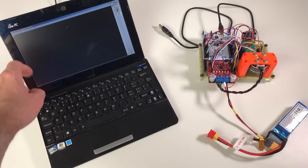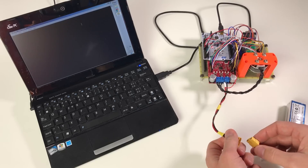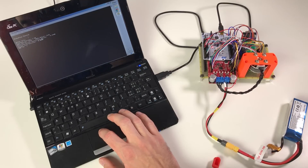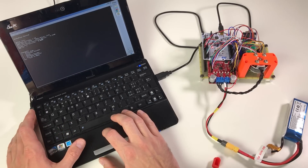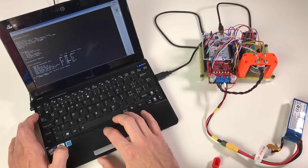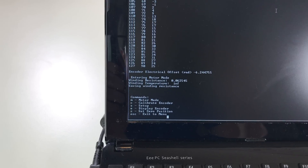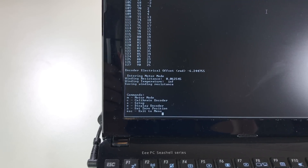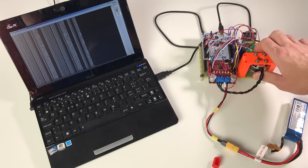To connect the serial I use TeraTerm. It's detected as an external drive. Now we connect the serial port, connect the battery, and push the reset button. Immediately we get information about the board, and if we push escape we get the commands: motor mode, calibrate encoder, setup, display encoder, and set zero position. The first thing to do is setup — I've already put all the parameters for my motor and driver board. You can also do calibration, which gives you the electrical offset and winding resistance. You can also display the encoder data, which is very useful to confirm your encoder is working.